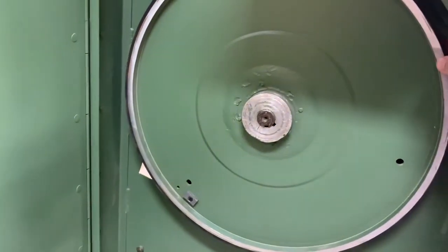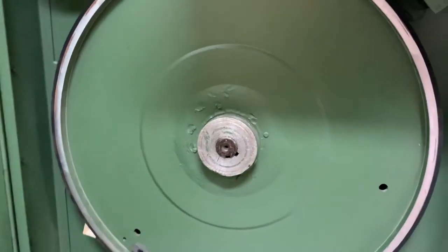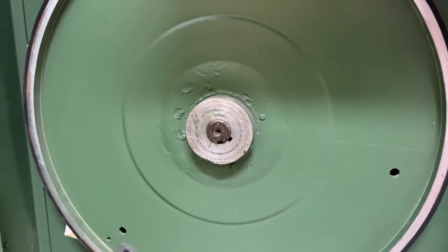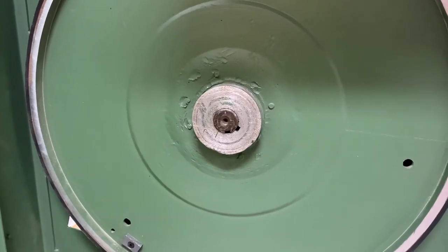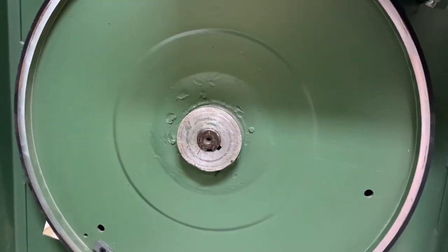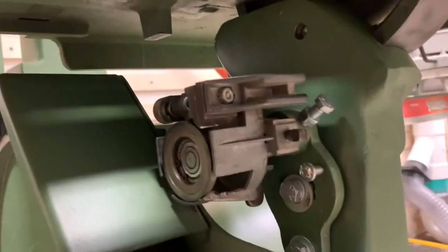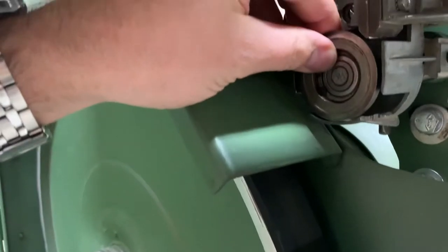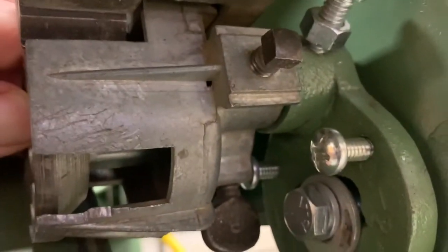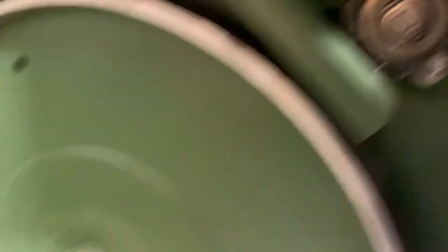Our trouble is down here on the bottom side of the saw with this wheel. Forgive me, it's loose - it's wiggling on the motor shaft. The steel motor shaft is much harder than the aluminum hub, and over time and vibration, the hole of the hub has enlarged itself and it actually rocks on the wheel. When I powered this up at the machinery dealer, after just a few seconds of running, the wheel started moving off the shaft toward us, which isn't great. Another funny thing is this lower blade guard - it doesn't actually go in far enough, it hits on part of the casting up there, and we need to sort that out. That one's relatively easy to fix; we can just saw that off. The major work is going to be the electrical conversion and then repairing the wheel.